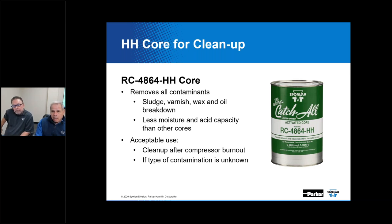We had a rash of problems here a few years ago in air conditioning systems where there was some process fluids that were residual to the system that were coming from a particular component that was installed, and they were wreaking havoc with expansion valve operation. And it didn't matter whether it was one of our valves or any of our competitors' valves, they all tended to foul after they ran for a certain period of time. And it was a really big exercise in an attempt to find the source of that contamination, but ultimately we did. But I guess the answer to the question overall is anything that's in the system, from our point of view, that's not refrigerant or not the lubricant that you need to keep the compressor alive, is a potential contaminant.